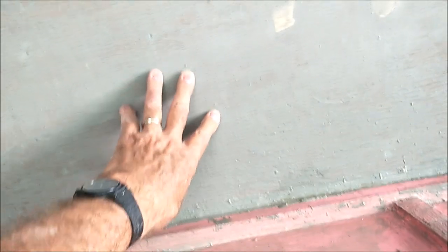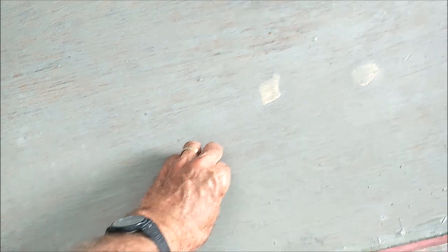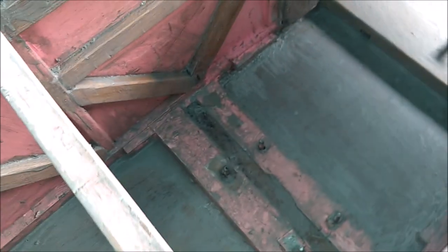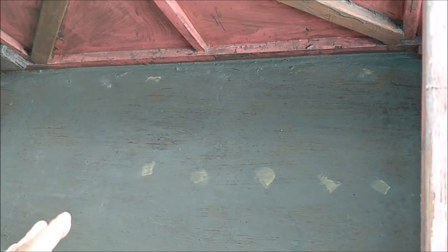You can feel just a little bit of texture, and if you slide the sander down just one pass it's smooth. So yeah, this is definitely the way to go — watery epoxy. Even on the bottom, it looks real gray and you're not seeing the wood — that's two coats of thin and that is perfect, it really did a good job. Lesson learned: mix your epoxy thin, and if you need to make a second coat, go ahead after about an hour of drying time.